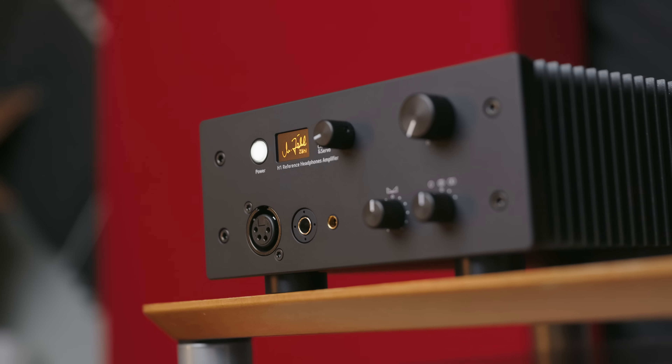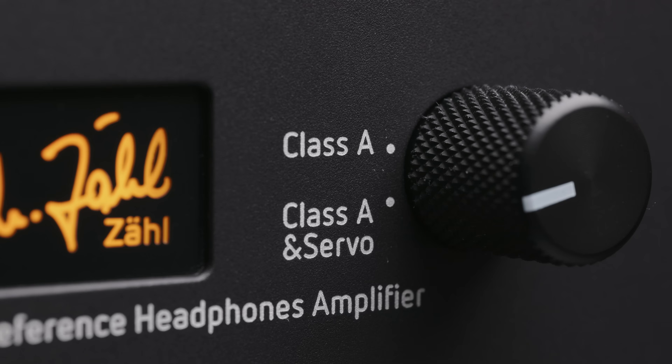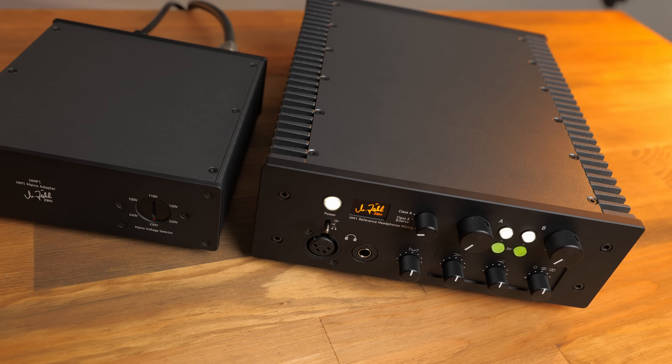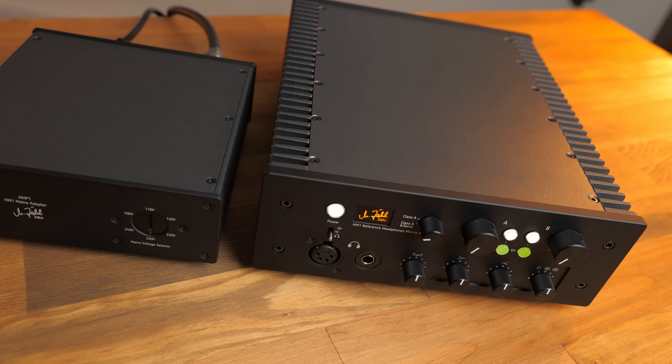The operating point for the transistors in this amplifier were first specified by theory, then by measurements on sample units, and then fine-tuned through listening tests with various mastering engineers. This is an amplifier that doesn't just rely on measurements alone or massive amounts of feedback to get a good SINAD score and call it a day. It is, at its core, a fantastic Class A design that doesn't even need feedback to perform well, fine-tuned through a mix of objective and subjective input from people whose entire job is mastering music, and then it gives you the option for just enough feedback to push performance even higher. The result is stunning, and why I bought an HM1, and it's been my benchmark since.